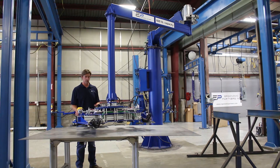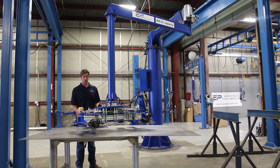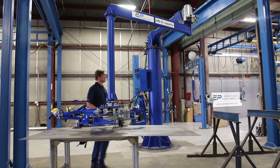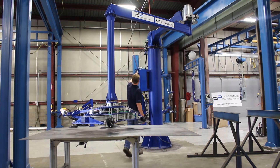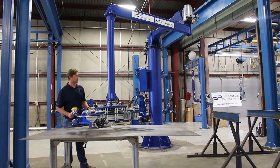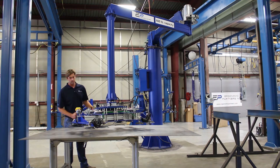Due to different widths, we've put a vacuum lifter on here that can extend or retract. We also have a brake right here — if you turn that brake on you'll see a brake on the secondary arm as well as on the primary arm. There is also a pilot-operated check valve right here that prevents the release of the part if you lose plant air.